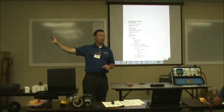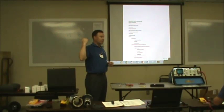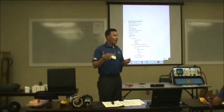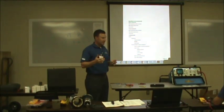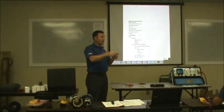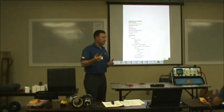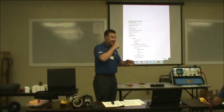It's tripping out because it's got RTDs, which is a temperature reading on the bearings. It's communicating with the PLC, saying if bearing temperature gets too hot, it shuts it down. And I'm going to tell you, my automation knowledge is limited. But anyways, I had to figure out what's causing this. So we go over and start taking temperature readings of the motor set beside it and this one. This particular bearing is running 20 degrees hot. We'll say it's running 180, the other one's running 160.